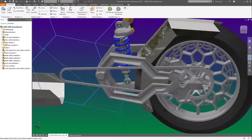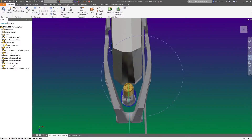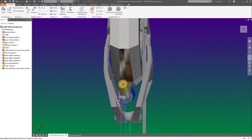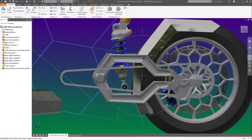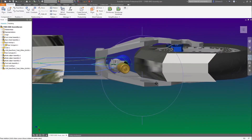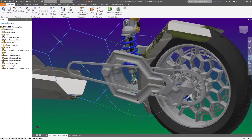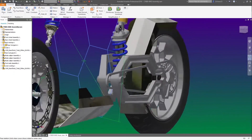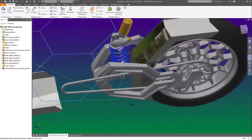It's all just freeform — that's in the name. So I need to remake this entire thing using parametric geometry, and it's going to be difficult because you've got your main pivot axle and then arms that come out at a certain angle, needing to be flat for a certain bit while also doing angles in other directions. Freeform allows you to make complicated shapes easily, but parametric design is not the best for making organic-looking things. So yeah, it's going to be a bit of a challenge.